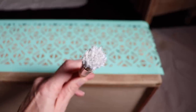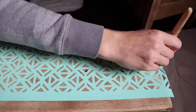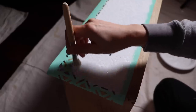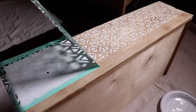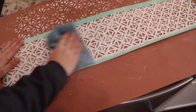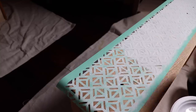I wanted to use a bright white on this piece, so I grabbed some Waverly chalk in white and a little stencil brush from the hardware store. I used a stippling motion to apply my paint so it has a slightly erased texture. I love the adhesive on the back of this stencil — it does not slip, stays in position, and is really easy to reposition. Most impressively, there was no leakage and no seeping — my lines were crisp and absolutely beautiful. I actually used one piece of stencil for all my drawers, just wiping off any wet paint in between, and it worked perfectly every time.